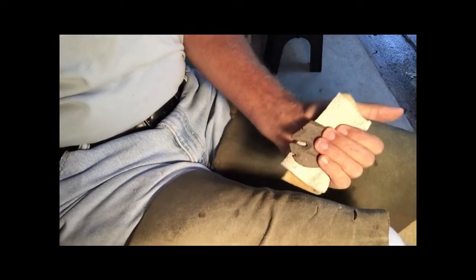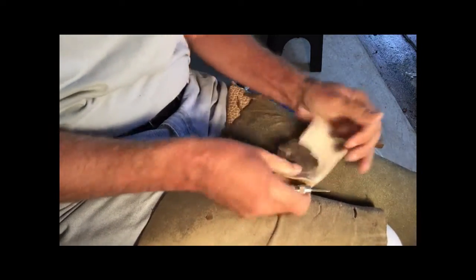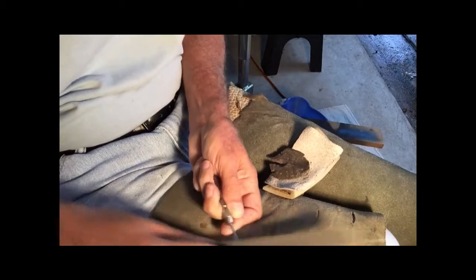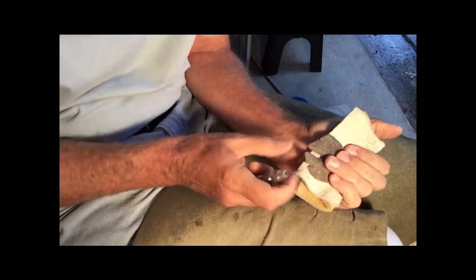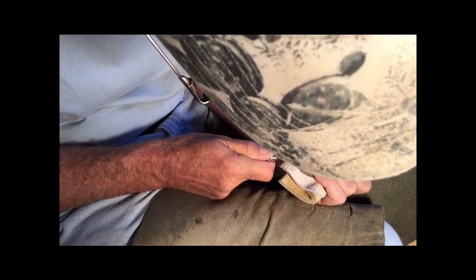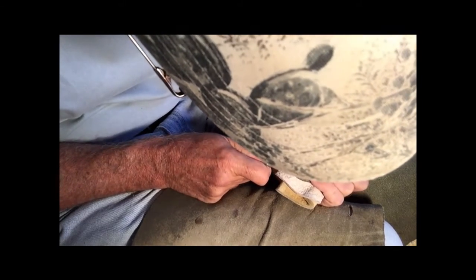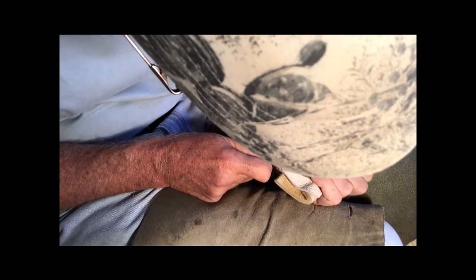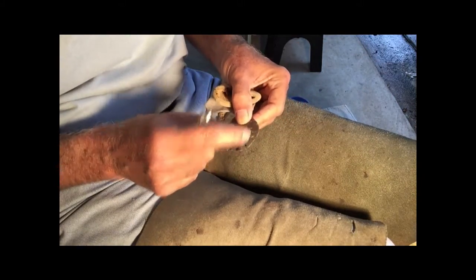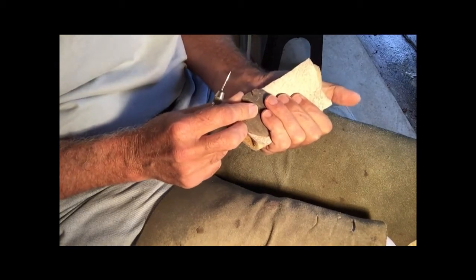Do it as fast as you think you can get away with it. Little things like horseshoe nails are good for cleaning up the sides of your notches and trying to turn the corner. You almost need a little hook on it, but since they're narrow you can come up and sort of push laterally. Be careful — if you touch knife edges, they break. One thing you can do to lessen the odds of that is make the insides of your walls not knife edges, but I would suggest making sure you're not going to have to adjust it before you do that. Because if you want to make the notch wider later, it'll be hard and you'll be at risk.